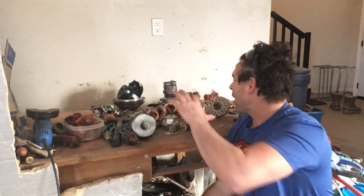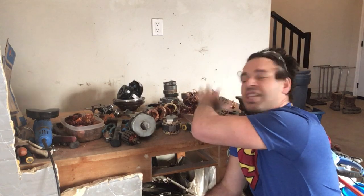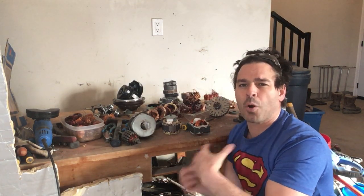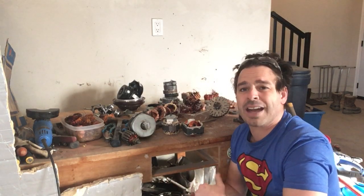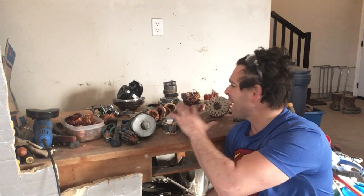I've already separated a number of them. I'm going to weigh the copper separately from the steel core to figure out the difference in profit. The second question was about the different styles you come across and how to open those — I do have a couple left unopened so I'm going to show you how I do it. The third question was: are all motors copper? And the answer unfortunately is no. A lot of newer motors, especially from manufacturers, have replaced the copper with aluminum. So the first thing you have to do before you take it apart is do the scratch test.